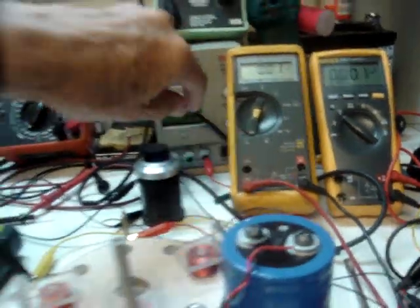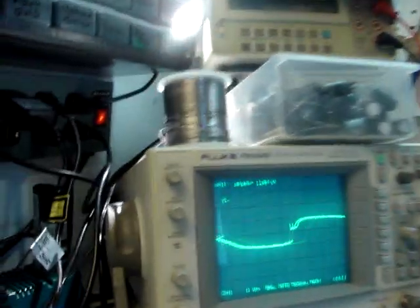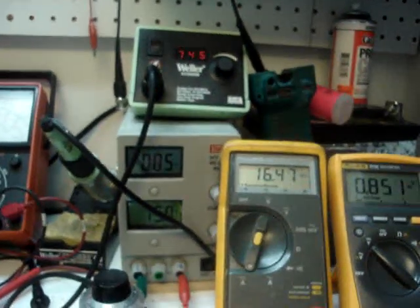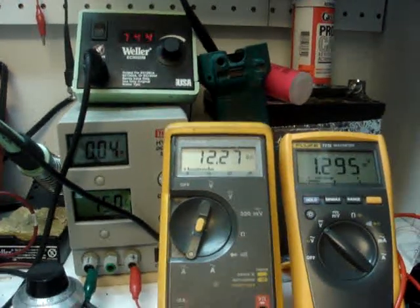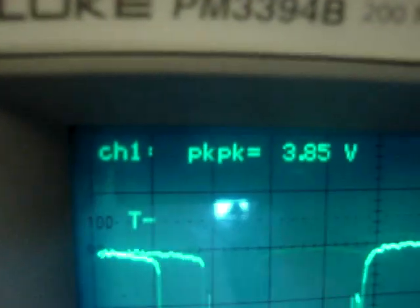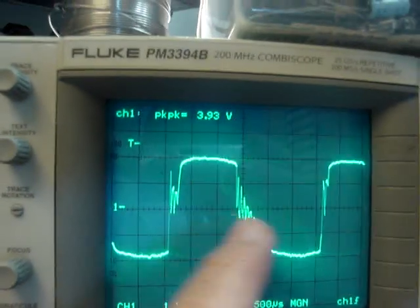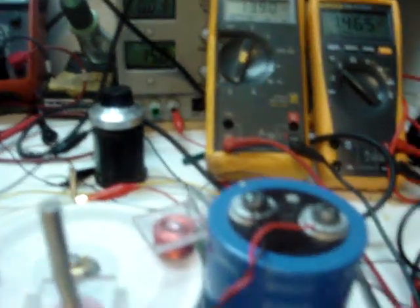Let's turn on the power supply — give her a flip. She's so reliable, she always works. Now this is the non-resonant waveform. The diodes are feeding and clipping into the filter capacitor here. You can see the current running up — we've got 16, 17 milliamps. I'm going to cut that down to about 10 milliamps and let the voltage creep on up. You can hear the motor winding up here. Right now it's 3.94 volts peak to peak. There's some ringing on the diodes and in the coils as they switch on and off to charge up the capacitor.